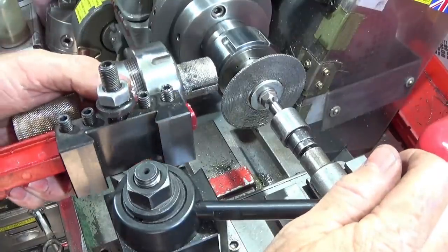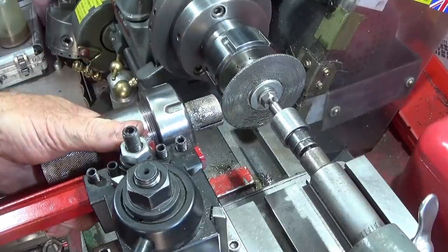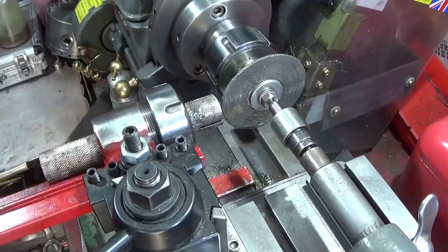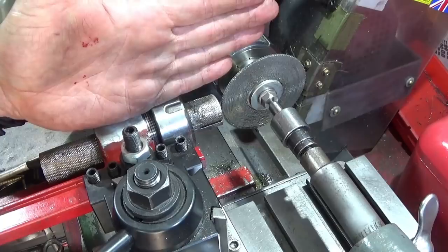And when I put the fixture back on the lathe, both the centre height and the centre of the bar, with the carriage being up against the stop and the carriage locked, is dead centre.